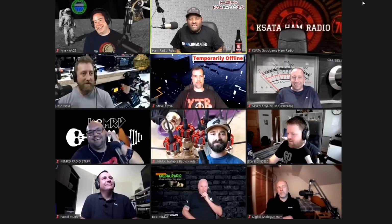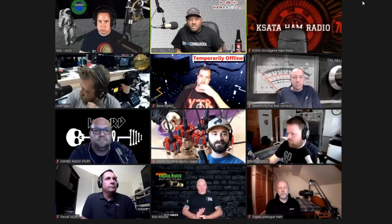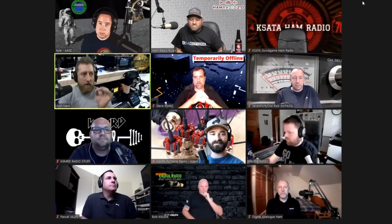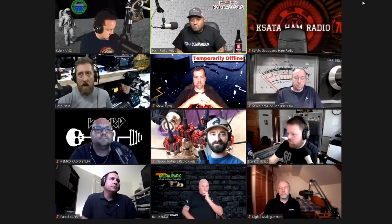So what's the one you did a video on, the one that you brought to Austin when you went to visit Modern Rogue, I think it was? That was an end-fed Chameleon, the MCOM3. Yes. So that antenna, I don't take when I'm likely going to be doing QRP, because it's just kind of overkill. It's a portable end-fed that will do 6 through 80, I believe, is what they advertise. And it's resonant. It's an end-fed, so it does pretty well. I ran that with the 891 when I went to Modern Rogue, and that seems to do fine.